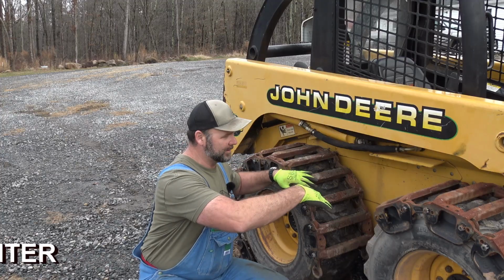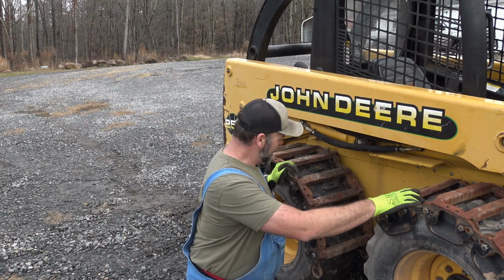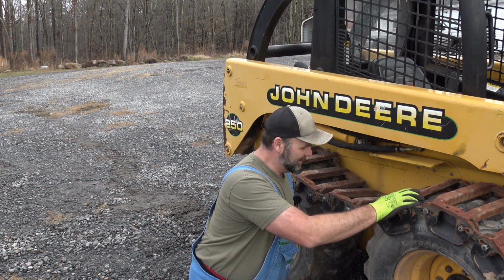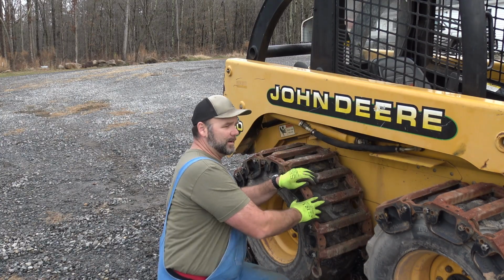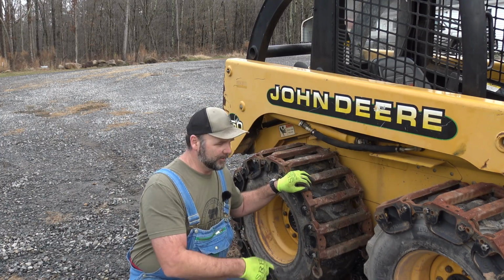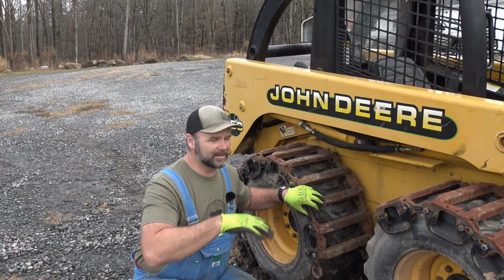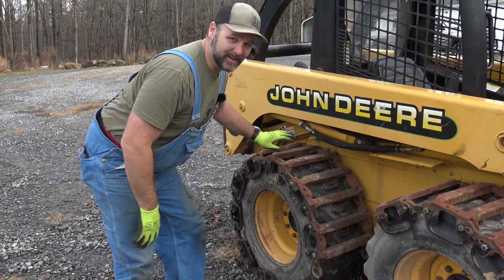We went on and rolled the grouser track up here. I've got the ratchet right here to hook them together, but just testing out, I can tell already we've got to extend these just a little bit. So we're going to roll this rear one off, and we're going to back it off 3 rungs. In other words, we're going to back off 3 bolt holes, the exact opposite of what we just did with the Tracks Plus tracks. We'll show you how it's done.